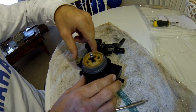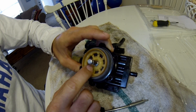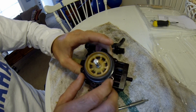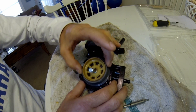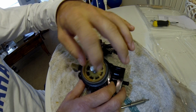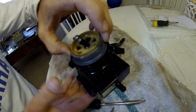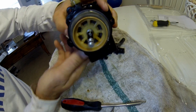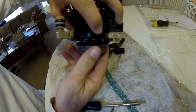You can just unscrew this. There's a hexagon-shaped nut attached to this piston. By undoing or unscrewing this, it unscrews the piston — otherwise you can spin this all day and nothing happens. It's easy to turn it upside down where gravity keeps it pulling down on it.